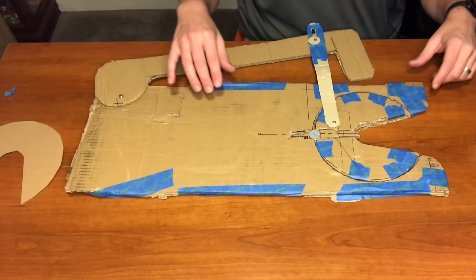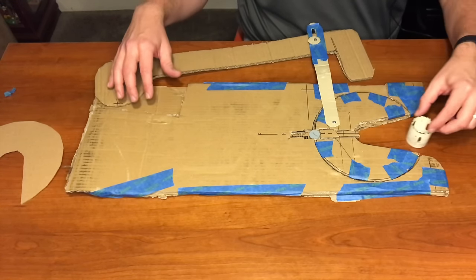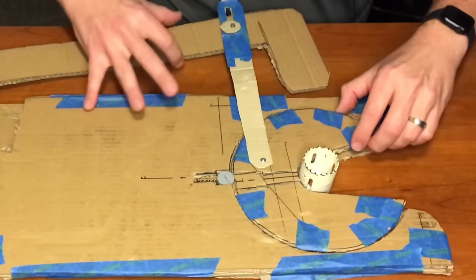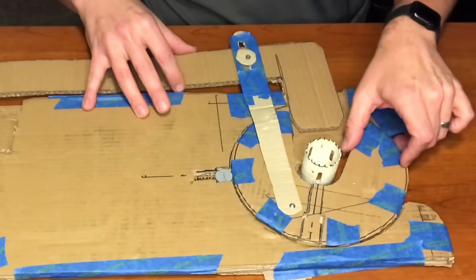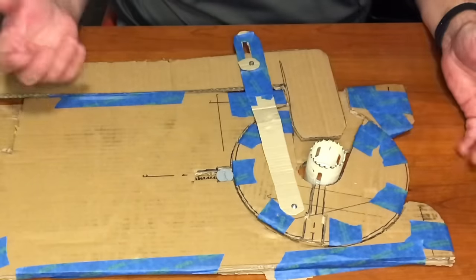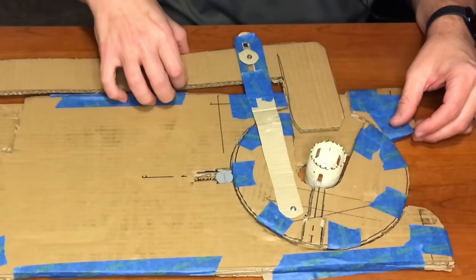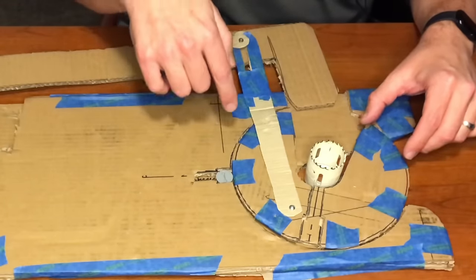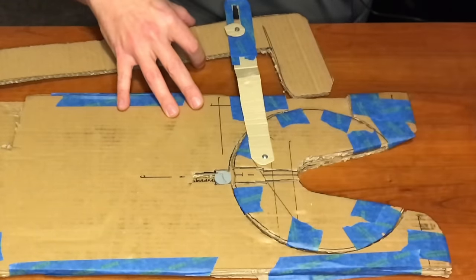So once again, when it comes down, the catch wagon comes down the train, slows down. This guy finally pushes the ball bearing out of the way. At that point, the jaw starts to rotate, the hammer comes down all the way, latches into place just like that, and now the axle is captive in there, can't go anywhere. On the other side, the cam pushes the hammer up and it starts to clear, and at this point, if the assembly is free enough, the jaw can just fly open like that and release the train.